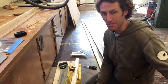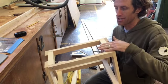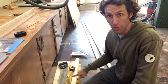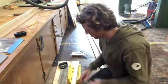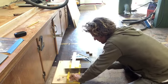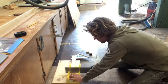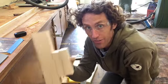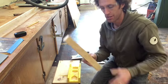For the other pieces, these have to be very precise or a little big, because otherwise they won't fit inside the pieces I've already pre-cut for you. So here we go — five and a quarter. I'll mark it and use my speed square to get perpendicular lines. We now have our five and a quarter and eleven and a quarter pieces from this block — that's all we need from this stick, so you'll have some extra. Set that aside.